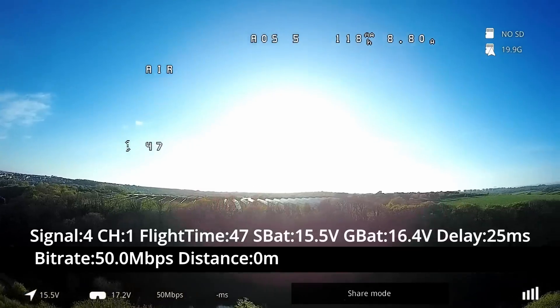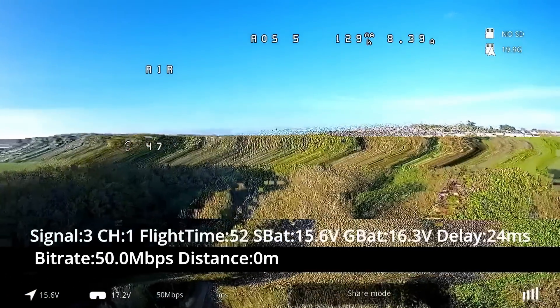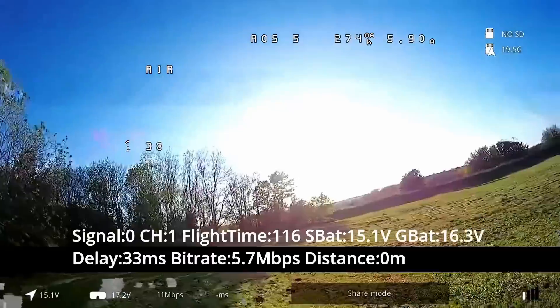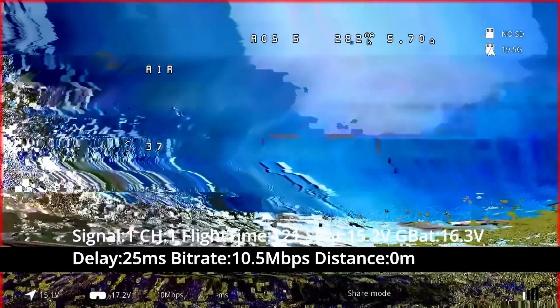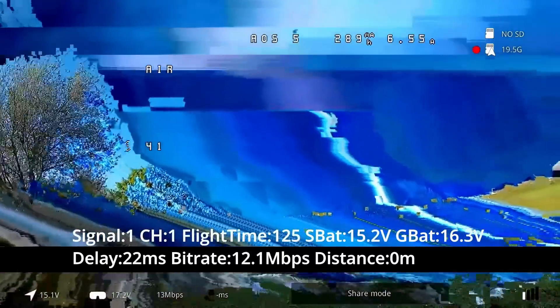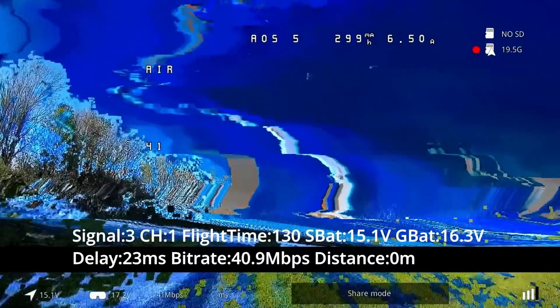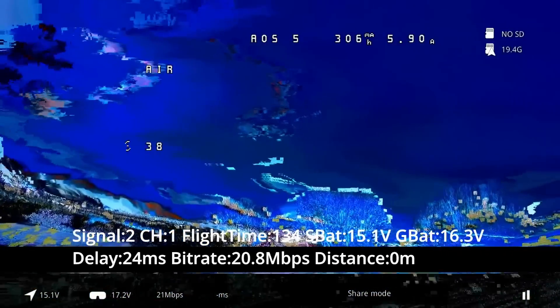I am still doing a lot more testing and trying to understand what the cause of this is. I've been looking at information on the main goggles such as the bitrate to see if there is anything causing this, and I'm going to do more testing over the next few weeks and share my thoughts once I've done that. Here and now though, I'm not seeing anything to clearly show what is causing this. What is bizarre is that when it starts to do this at signal loss it just completely melts down — it's like it's not even bringing in any new frames — but I do need to do more testing to fully understand it.